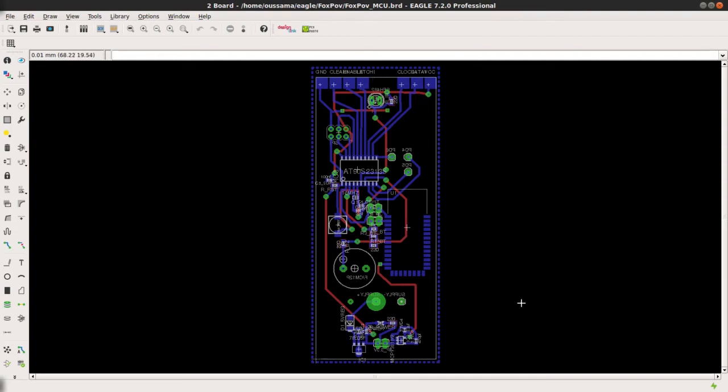The second mistake I made is that I set the rotation center not in the middle of the board. I thought it would not matter much as the PCBs would not be that heavy. But I was wrong and it was wobbling a lot while it was rotating. So I ended up adding a few extensions to it for it to be balanced.